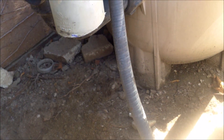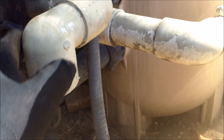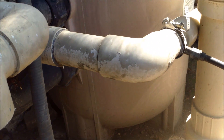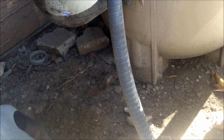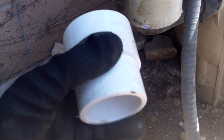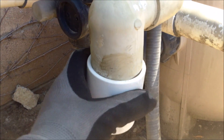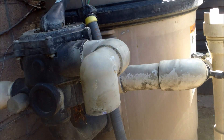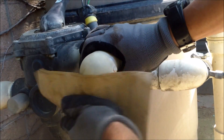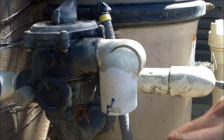After I matched the pump up, I decided to cut some more of the pipe. I cut all the way to the one-and-a-half-inch elbow. This pool is kind of a pain — it's got one-and-a-half-inch and two-inch pipe mixed together. So I went ahead and cut all the way up to give me some more room for this pump. I'm going to use a one-and-a-half-inch fitting extender. I'm going to sand this pipe down a little bit to get the paint off so it can slide on there easy. I'm going to clean the pipe off and make sure all the fittings are clean.